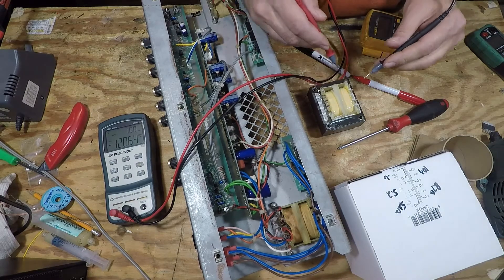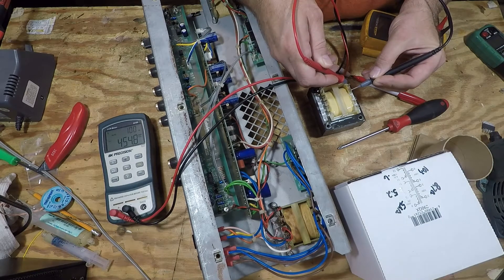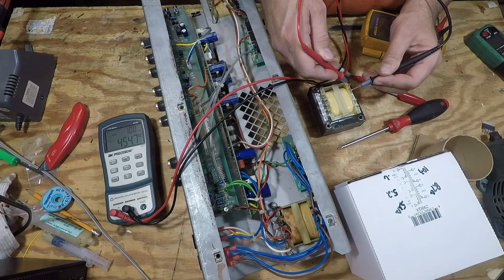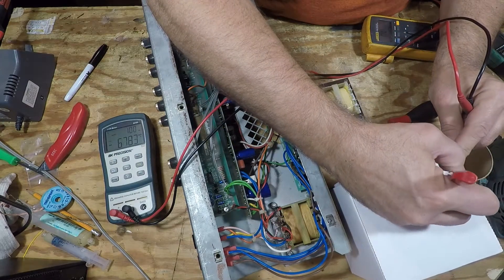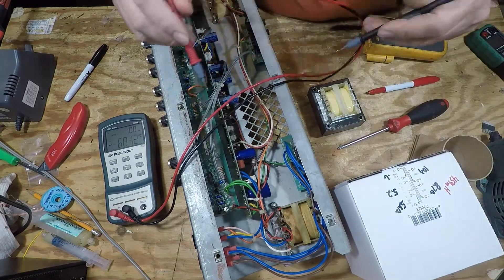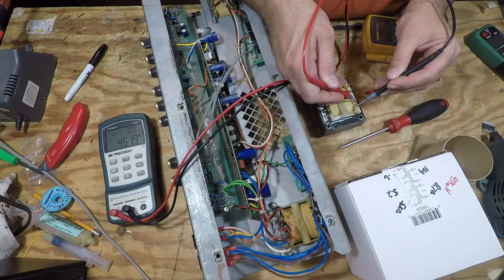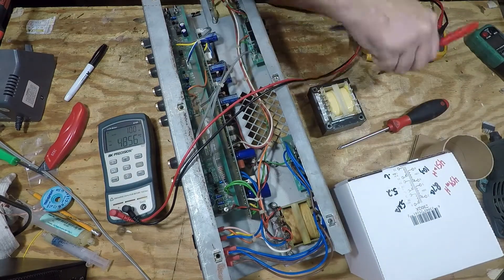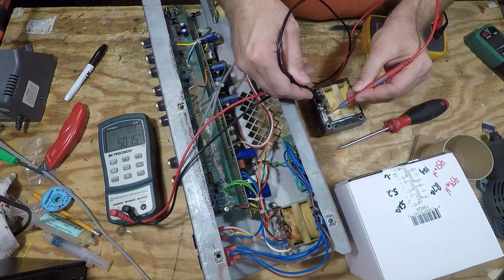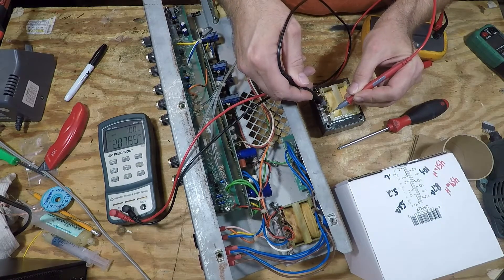I also like to record my readings using the inductance meter. I set it for L and use 100 Hz. Pins 2 and 3: 454 millihenries. Pins 5 and 6: 451 millihenries — these two should be pretty close usually. Between pins 9 and 10: 2.9 Henrys.